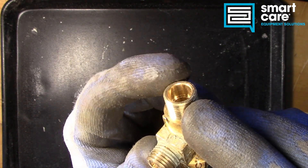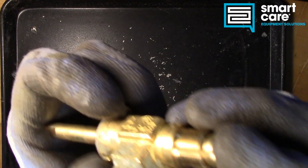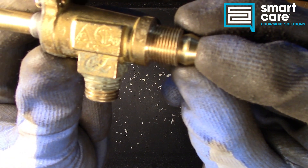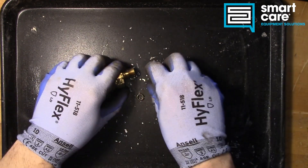So if we look in the opening here, there's a small tapered lip, and that ferrule has tapers cut onto it so that it sits with its taper matching up to the taper on the valve. When the nut is tightened down with the ferrule inside, the ferrule crushes.